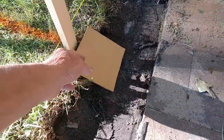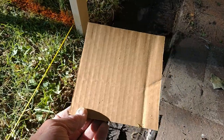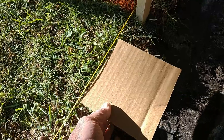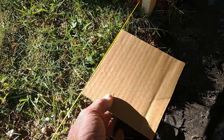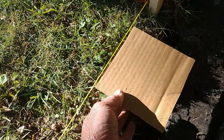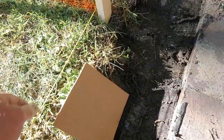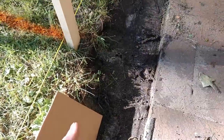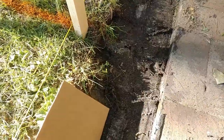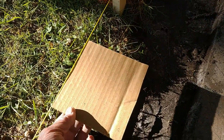So here's what we got. This piece of cardboard represents my 6x6 post — it's 5.5 inches by 5.5 inches. I want my post to be flush with this string and centered on the sleeve. The reason for that is when my 2x comes across here, I want to cut a notch in my 6x6 post for that 2x to sit on top of, to help support it — not just nailed to the side of it.